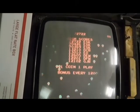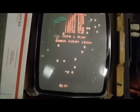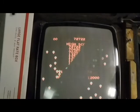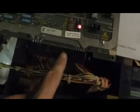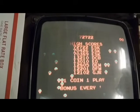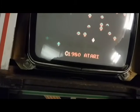It's working. I'm starting to think the little glitchy that I was seeing earlier — I don't have it on camera — it's probably just from having a bad connection right here at the edge connector. They're kind of hard to see, but you can kind of see it shake a little. I'm thinking that's part of the edge connector issue.